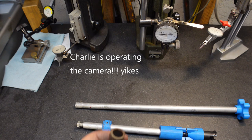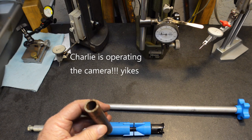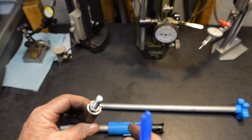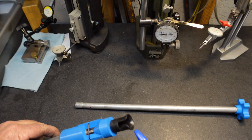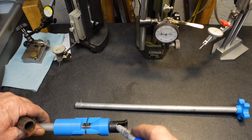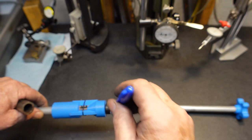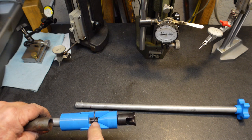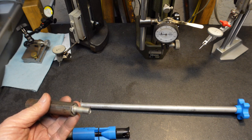A little extra information here — I know some people are going to wonder how did I make this. Basically I had a piece of pipe with good wall thickness on it. The 3/8 bolt actually fits right into the end of the pipe, so that was simple. After I bell-mouthed this piece — which you saw me fooling around on the forge doing — the bell mouth is just to make it simple. Other than that, an end mill goes in, make your cut depth, and just come back sideways to make the slot. So: in, then a slot.